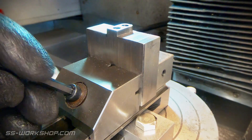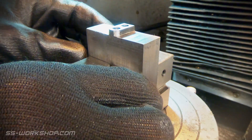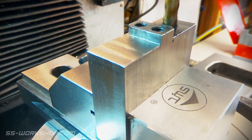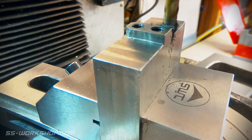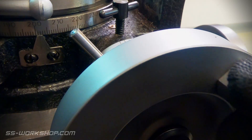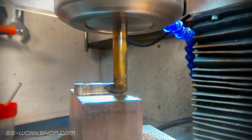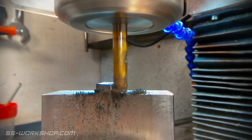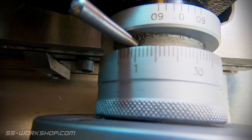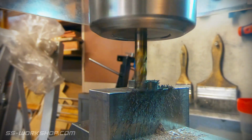Since the last episode I've made myself some toe clamps which make mounting the toolmaker's vise much easier. I make the cuts in a couple of passes, as a 6mm end mill has limited rigidity. But the benefit of a 6mm end mill is there's a better surface finish, because they can run at a faster RPM.